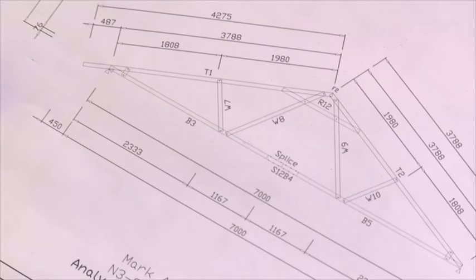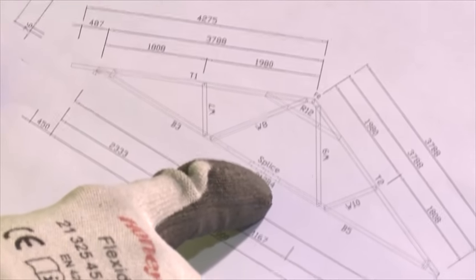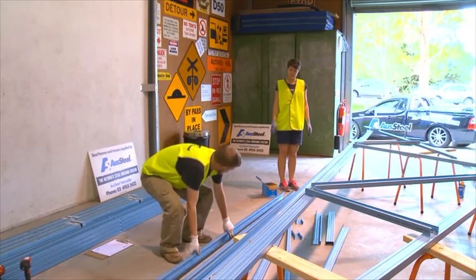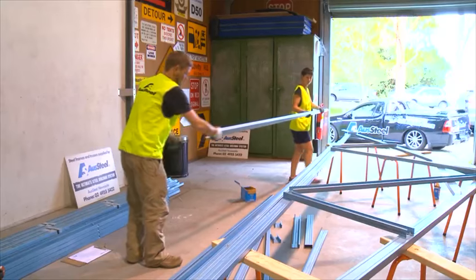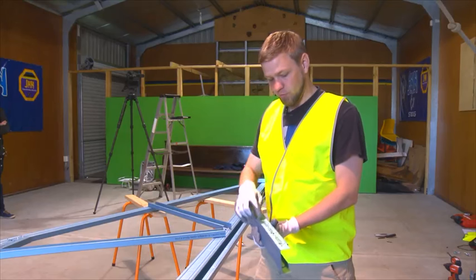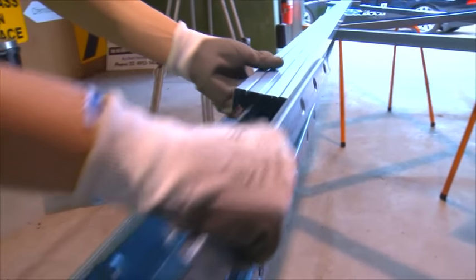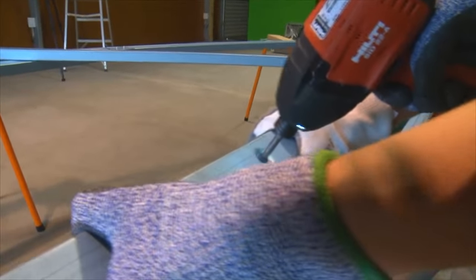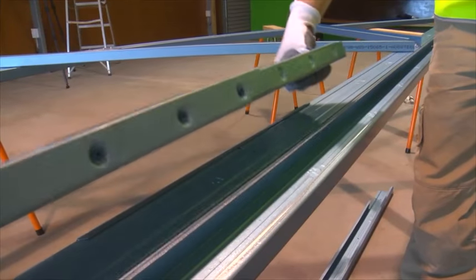This particular truss is our back-to-back truss. You'll build it from the flat side up with B3 and B4 to start with. Again, with B3, make sure the label is on the left-hand end. Now, when joining your bottom cords together, you'll use B4 and they will box together only one way. Other side as well.